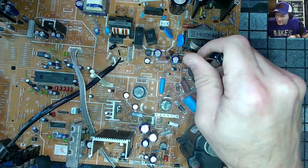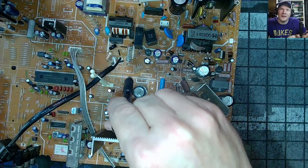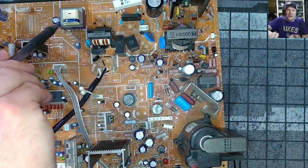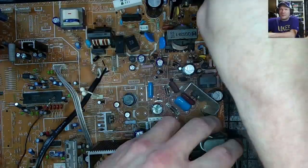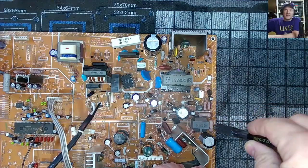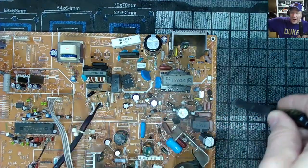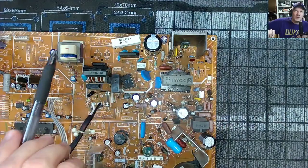Goes over this way. I'm gonna ride this train with you, okay? And then over here, and then it comes over here, and it cruises up this way around this transformer, including that capacitor, back around this side of the board, okay? So that's that whole spot. What I just carved out for you again, that whole block is our power block. All this up here is basically our power supply.